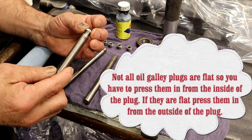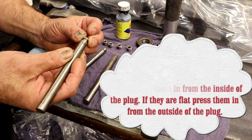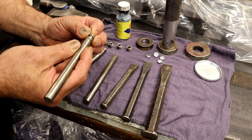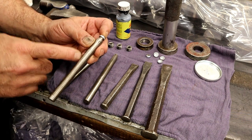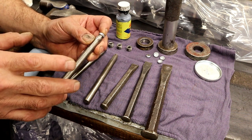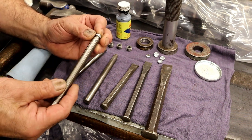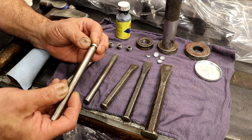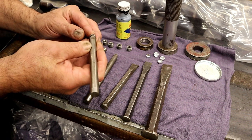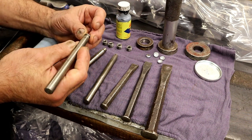One of the tips is you don't want to machine this down where it just barely goes in. By the time this gets pressed in, it's going to get stuck there. You're going to be frustrated, throwing it across the shop, and we don't want that. So we're going to push this in and it's going to be looser, because when it gets pressed in it's going to shrink a little bit, and that's okay.